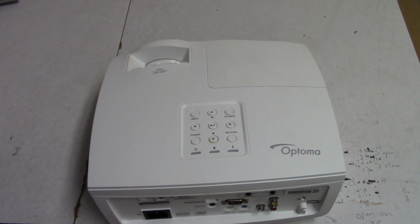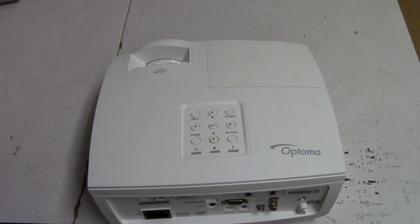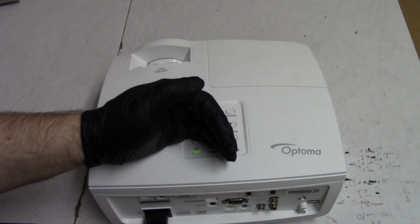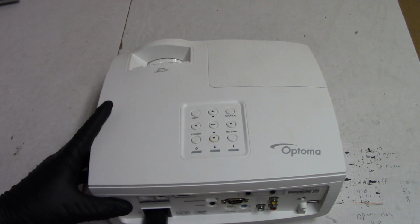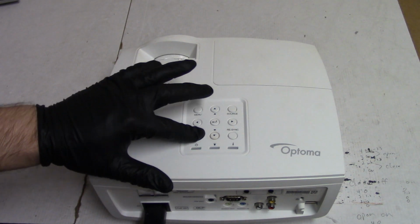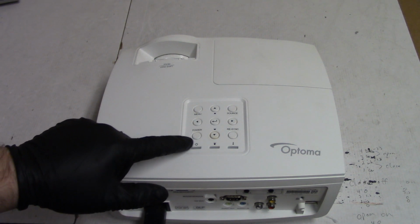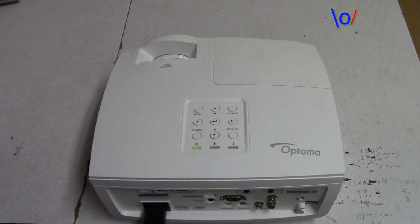So let's get the power cord, not bump the tripod. Let's see, standby. That standby light looks brighter. I must have had a bunch of crud on it. I wonder if that was causing the problem. I wonder if the rust around that LED was creating like a weird voltage thing so that the diodes wouldn't steer the buttons properly. Just a theory.